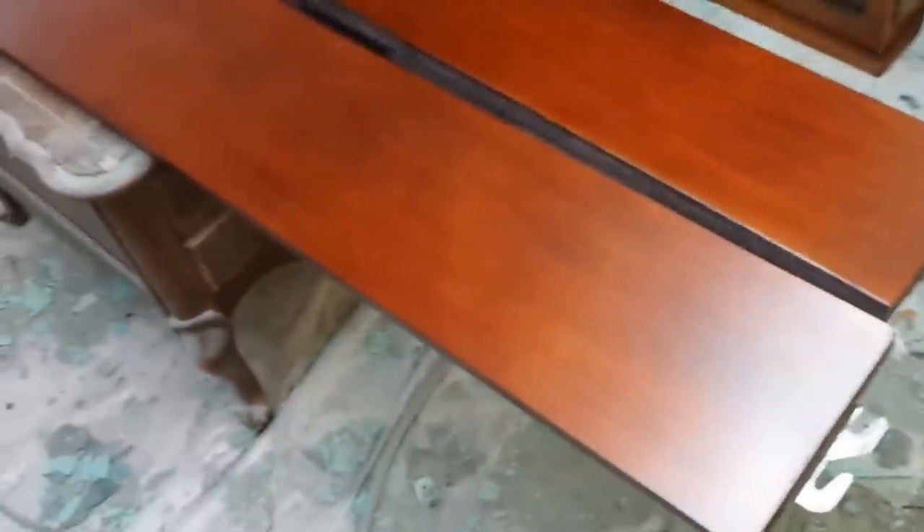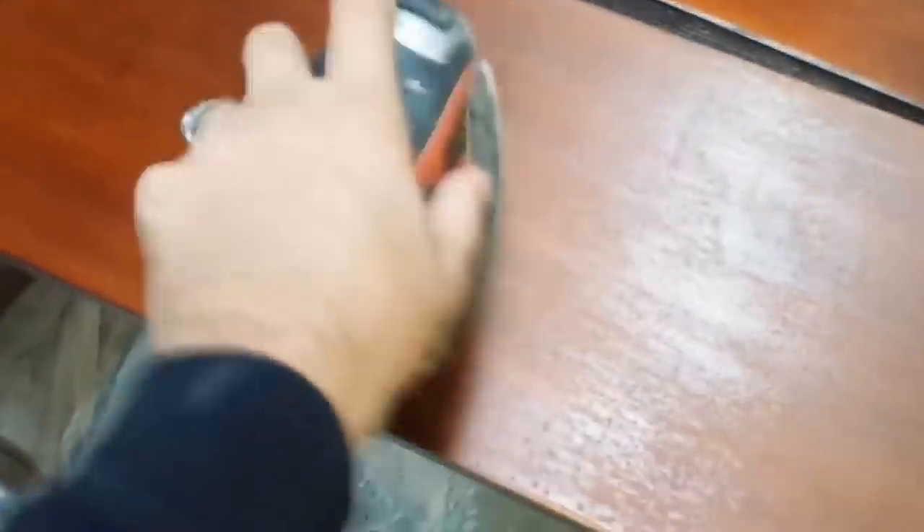Of course it's going to be loud, but you'll get the idea as I'm doing it. This will be from a first-person point of view here so I don't have a way to hold the camera up. Basically all we're doing is scuffing up the surface — you don't really need to sand through too much. There's the original finish and there's where it's scuffed up. What that's going to do is give the paint a bonding surface so it's much more durable than just painting right over the high gloss finish.